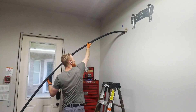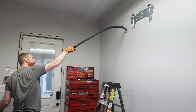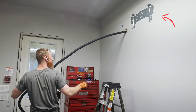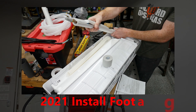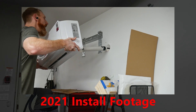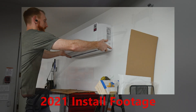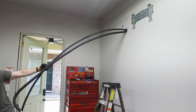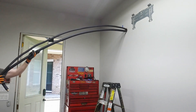Here are the results of what I consider the second mistake on this install. Normally on a unit like this, you'd have the hole going through the wall on the right side, not the left — that way you can bend the lines out from the air handler and poke them through the wall when mounting, making connections to the long refrigerant lines outside in a more convenient manner. My left-side hole orientation required me to make the connections for both the 6mm and 12mm lines to the air handler inside the building and then poke it all through the hole.